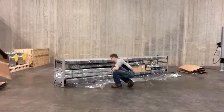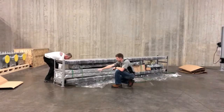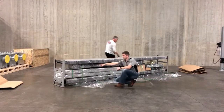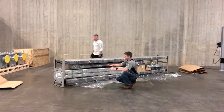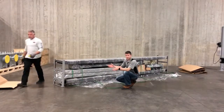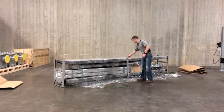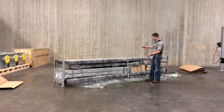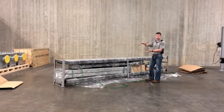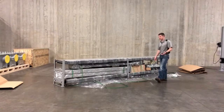As you notice here when we start to pull even more pieces out, we've actually packaged our lift with the post and crossbeam unloaded on one side. We do this so when the forklifts come in, it's a little bit easier to move around. We've also gone ahead and added bracketry in the center — this is just to add more support so when the lift is being moved around, we're not getting separation in those runways. That way, you won't run into an issue with the runway getting bent, fatigued, or damaged.